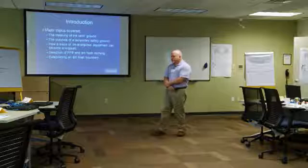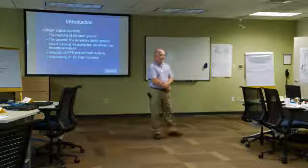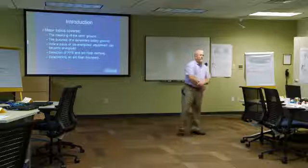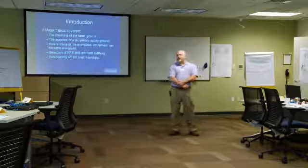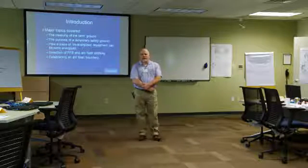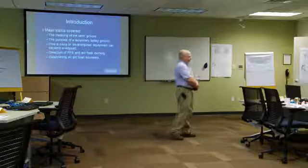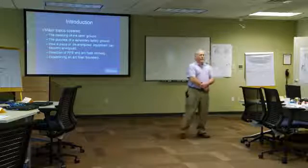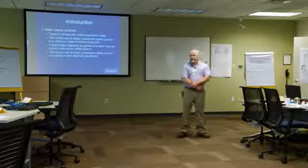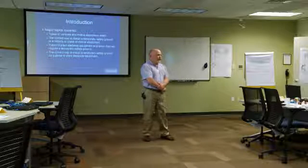A little bit of an introduction. Some main topics we're going to cover today. We're going to talk about the meaning of the term ground. We're going to talk about the purpose of the temporary safety ground. We're going to talk about how things can become energized even though we have de-energized them and disconnected the electrical power source. We're going to talk about selecting PPE and arc flash clothing. We're going to establish an arc flash boundary. And we're going to talk about all the different kinds of equipment, mobile equipment, plant electrical equipment, and how to apply those grounds.